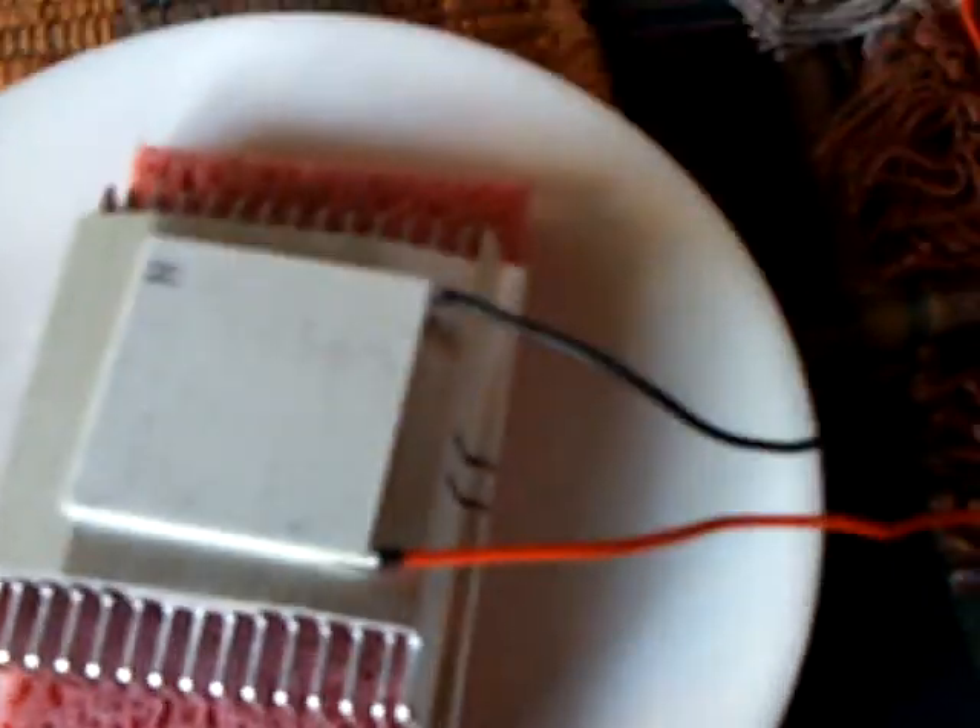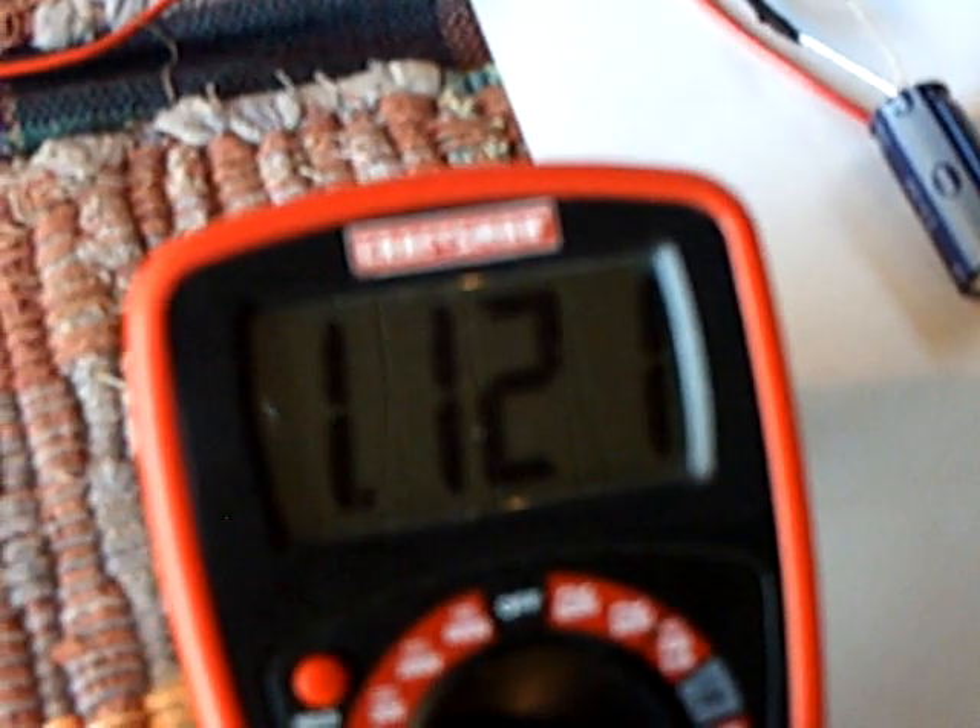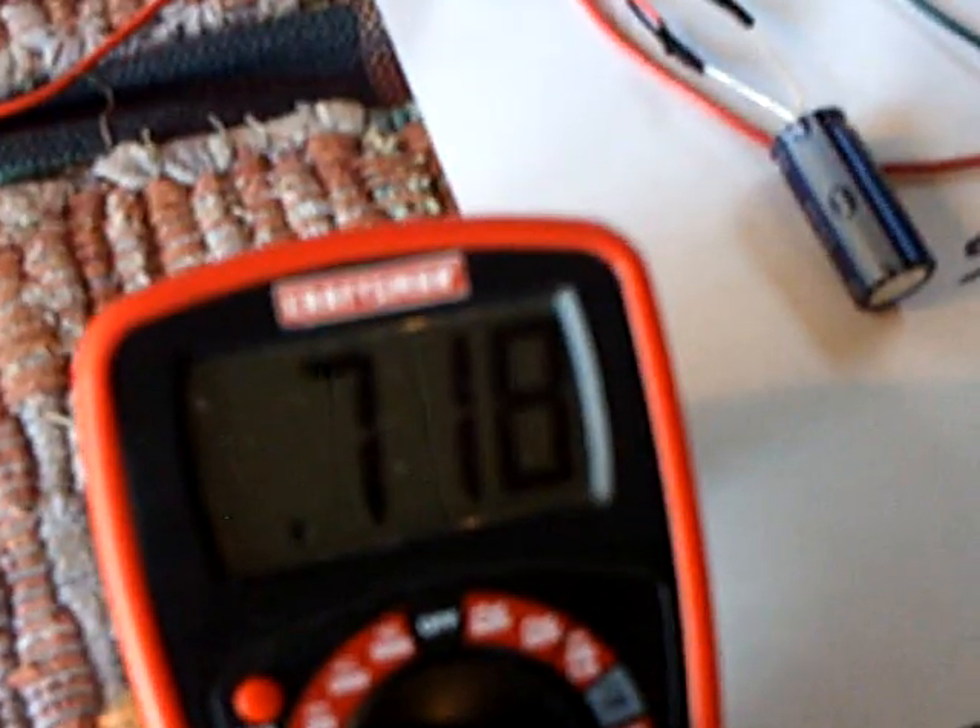The real find: I got to wondering if you could take an incandescent light and shine it on the top and paint it black, so the heat from the light would cause a differential. I started playing around with this light and found out by accident that there's a transformer in there and it's live. If you get that near this chip, watch — that is induction coming off of that transformer. It sits at about 3 quarters of a volt. I turn this light on — now I'm over a volt. Turn the light off, turn the light on. So these filter modules can be used as inductors.